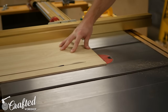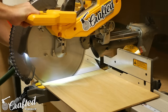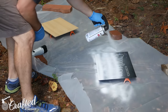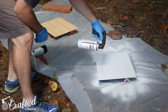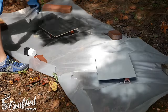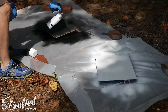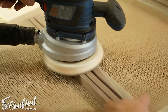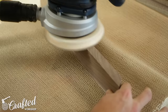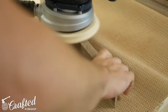With the grooves cut, I cut the plywood back to its final size on the table saw and miter saw, then did a quick test fit to make sure everything came together nicely. Next it was time for paint. I painted the back of the glass white, just like Brad did in his video, to help diffuse the light — though I think I did a few too many coats. It ended up blocking too much light and the lights are really hard to see especially in broad daylight. I also painted the plywood black to give it a nicer look. While the paint dried, I sanded all the pieces of the frame with 80, 120, and 180 grit sandpaper. I just love the way this air-dried walnut looks — it is absolutely gorgeous.